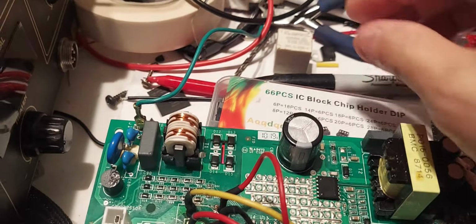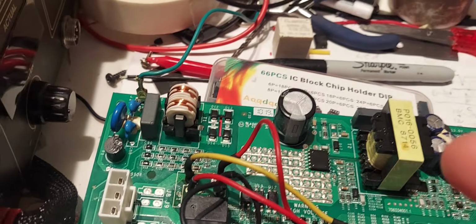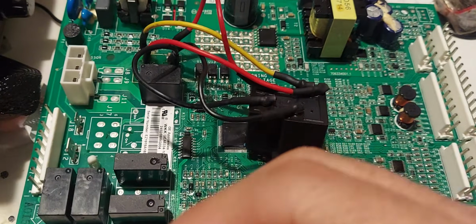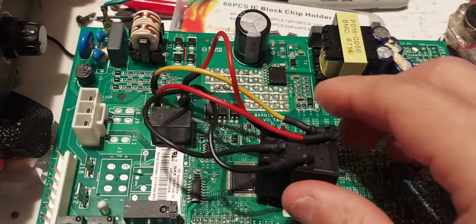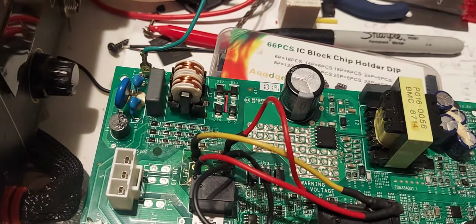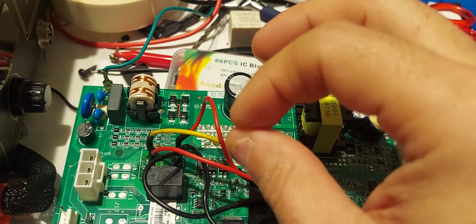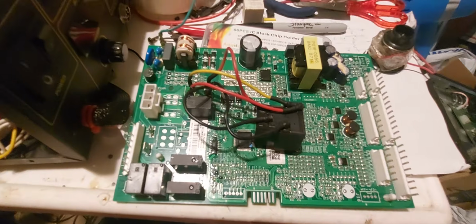Now, two things could have happened to this relay to cause the refrigerator to fail. One is the contacts inside got so black and crusty and burnt that they didn't make contact at all. When they clicked together, there was no switch action. So the refrigerator knew that, and maybe it does it a couple of times, and then the refrigerator shuts down, or what? I don't know what happens. Or it clicked on, and it made contact, but the contacts stuck together, so they wouldn't release. And then the refrigerator recognizes it, and of course it shuts down.